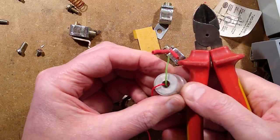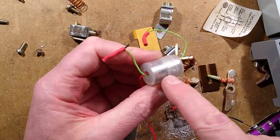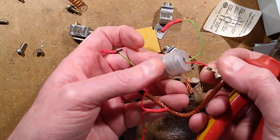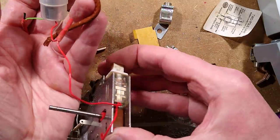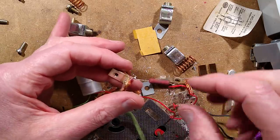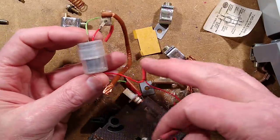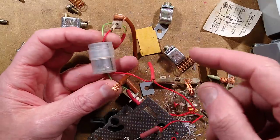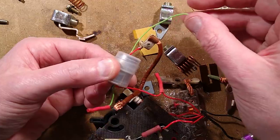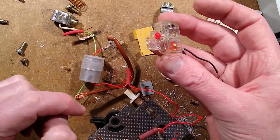I can see what it is — this is foil wrapped round and round to create a core — it's just a roll of metal strip. That's bizarre, I've not seen that before. The red wire is the test wire: when you press the test button it simply connects a resistor — about 1.2 kΩ, measured at 1,182 ohms — across this red wire, so current flows through this coil, inducing a fault current that's picked up by this single wire, the green wire, passing through that core. That induces enough current in this tiny coarse coil to release and trip the mechanism.